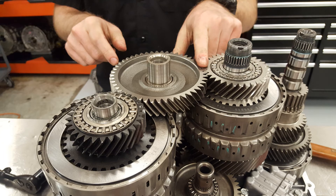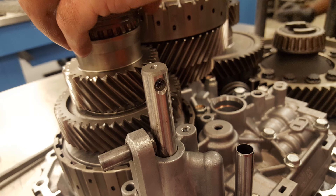It is very important for the counter shaft gear and the main shaft gear to sit really flush with each other, as seen in the picture where our technician is pointing his finger. If they don't sit like that, something is misassembled — maybe a shaft is not well seated in the transmission case — so you really need to pay attention. We're getting ready to put the reverse components in on the third shaft, but you need to make sure that the machined area and the rod are facing outward, because that's where the fork for reverse is going to be installed. That machined area needs to be facing outward, not inward.